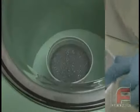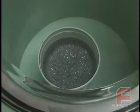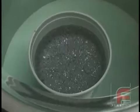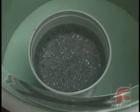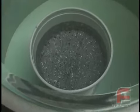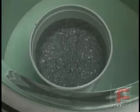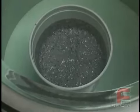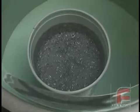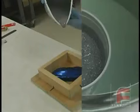Once it is properly weighed and mixed, our V340 is ready to be vacuum degassed. While degassing is not necessary for lower viscosity silicones such as V330 and V340, especially for simpler or less demanding casting applications, if you require an optimal, completely void-free mold, we recommend vacuum degassing the material. If you choose not to degas your silicone, you should be careful not to stir the base and catalyst too vigorously, and you should never use a mechanical mixer.